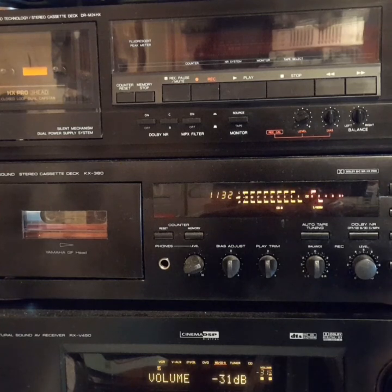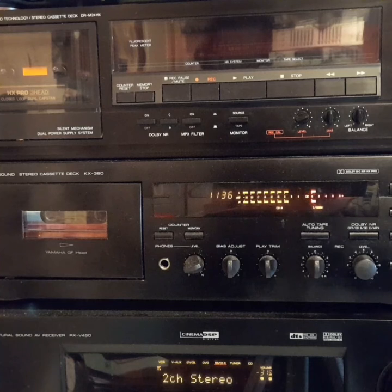This track is designed to enable you to use your tone controls or a graphic equalizer to set your system, including the listening room, for the flattest possible frequency response. It uses narrow bands of pink noise with center frequencies ranging from 10 kHz to 50 Hz. Each tone is recorded twice with a 1 kHz reference tone in the middle.